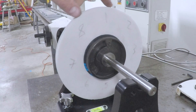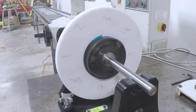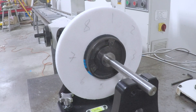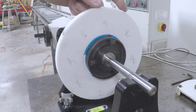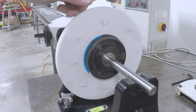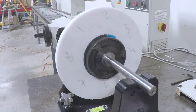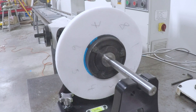Starting with one at the top, let's see what happens. Two at the top — trying to find the heavy spot. Now three's at the top and you'll see it starts to move. Three was probably not the heavy spot; we might have an issue at five. I keep saying five o'clock, but at five it caused that wheel to move a bit clockwise. Walking around: nothing at five, not much at six, but at seven — look what happens — five now moves it counterclockwise. So I do think we've got an issue where it's a little bit heavy at five.